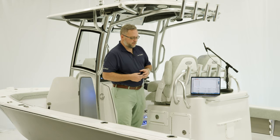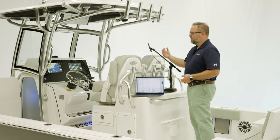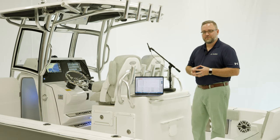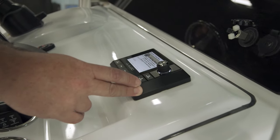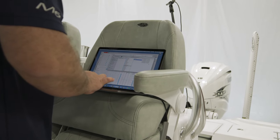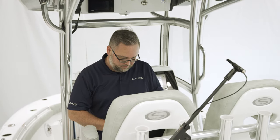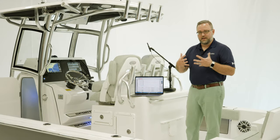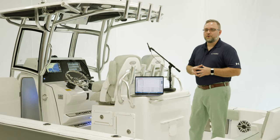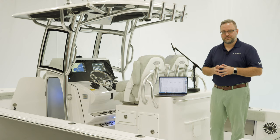What are the tools that we use? I've got my laptop here, a microphone, and I have a thumb drive plugged into the helm there with our test signals. The process goes like this: I will feed a test signal to every speaker individually, place this microphone where I can read what is coming out of that speaker, and make adjustments in our software to balance out what is coming out of that speaker in that area. I do that for every single speaker as we go around the boat to make sure the entire listening environment is as good and crisp as it can be.